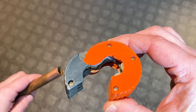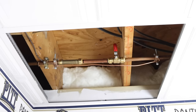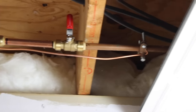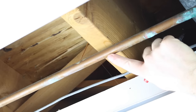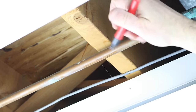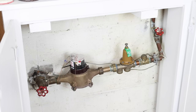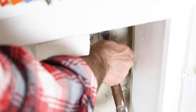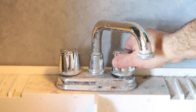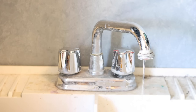We're going to show you what tools make this repair much easier, how to properly prep copper pipes, and also a tip that's rarely mentioned in other videos about SharkBites. SharkBites are great because you don't have to solder up in ceilings and create a fire hazard. Find your house main and shut off the water to the home — turn that main clockwise and then drain the water from the system on both the hot and cold sides.